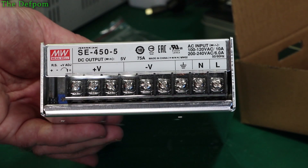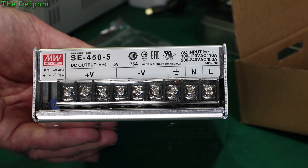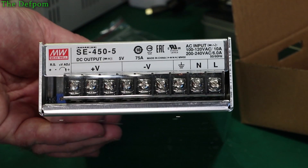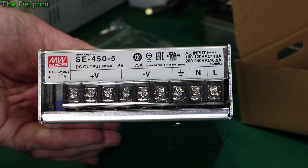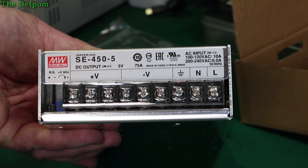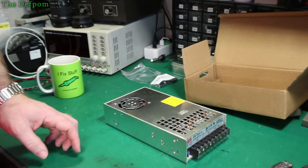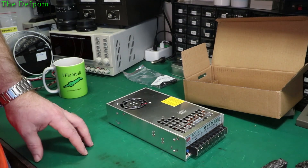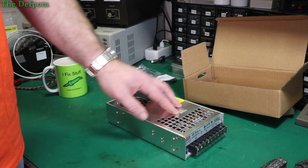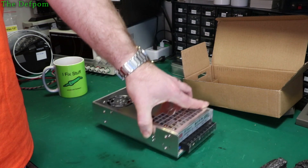The reason for this is that I need it to do a calibration on my DC electronic load. I started calibrating it the other day and discovered I couldn't put enough current — couldn't generate enough current to do the current calibrations. It's broken because I can't get enough current for the top range. A DC electronic load that can't measure current is pretty crap really. So I needed to buy one of these just to do the calibration and generate enough power.